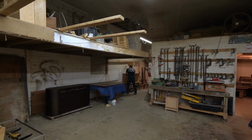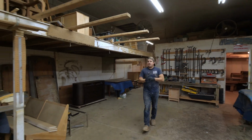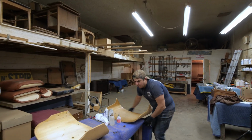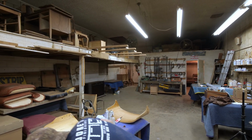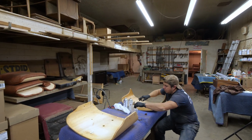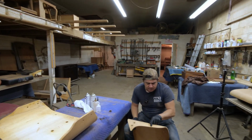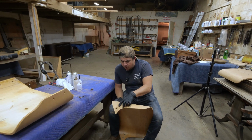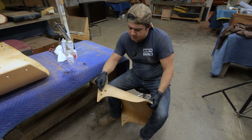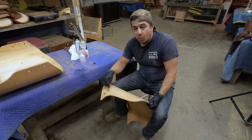But what we're going to do next is hop back over here to that Cofemo chair, the Italian Eames style chair. Since I only have about 30-40 minutes left of the day, I'm just going to start doing the repairs. On this chair you can see there's some veneer damage. Over here where the little T-nuts were, I'm going to glue these and then fill them, so when we're done and the T-nuts go back in, it'll go into fresh wood.